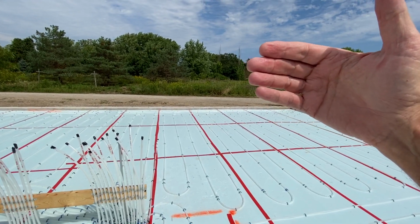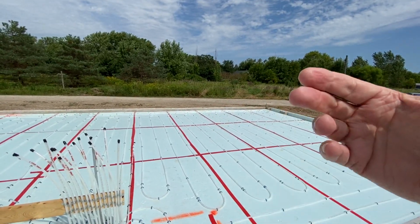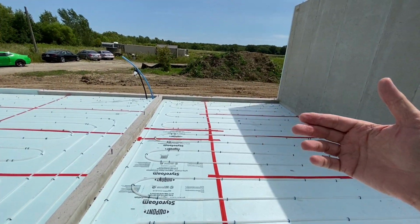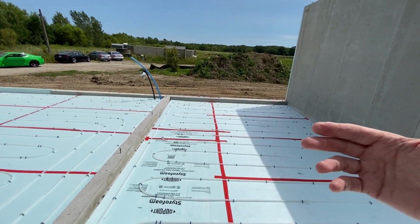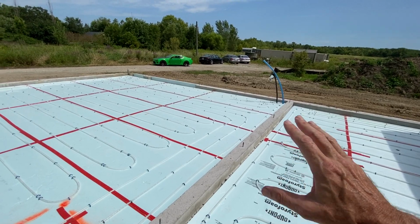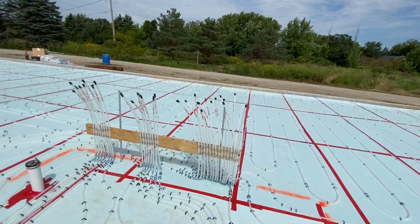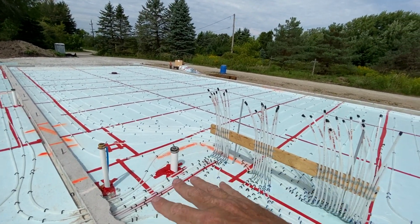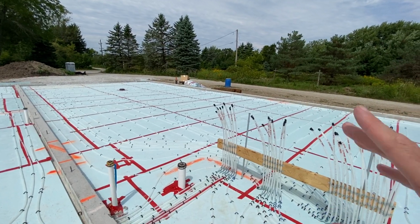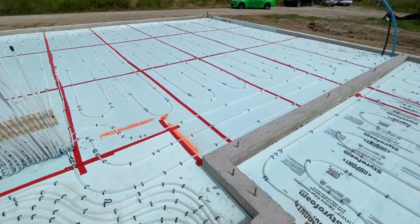The idea being that we don't want the noise and the vibration and the triggering and the burners and all that stuff to do their thing while someone's trying to sleep at 2 in the morning. Now, not everybody can hear it, but if you're a sensitive sleeper, having this burner mounted on this wall would be bad, because then you constantly hear the clicking and the fans and all that stuff. The hot water heater will go there. The whole house dehumidifier will go in this room, and the air-to-air heat exchanger.